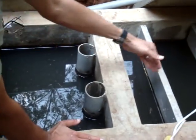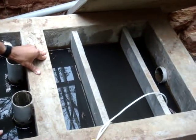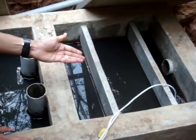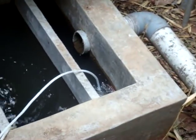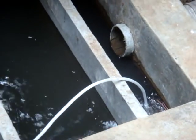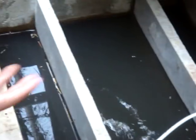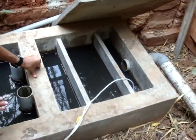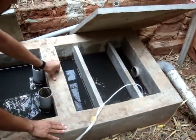And that brings it into a three chamber unit. This three chamber unit has a bubbler that we put in from an aquarium so that oxygen is put in and the dissolved oxygen level goes higher. This treats the water very well because the organic bacteria grow and eat up all the carbon material inside this water.